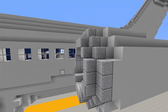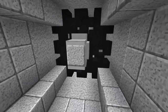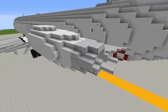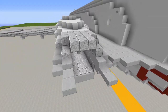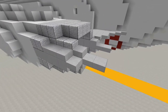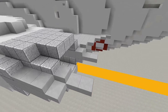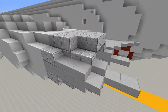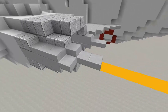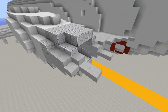On the inside of the engine you can see the fans of the forward compressor and the spinner against the main turbine shaft. Coming towards the back we've got the engine exhaust, and these pin-like things coming out of the exhaust are for the thrust reverser mechanism. Like a lot of turbojets of that era, the JT8D used bucket reversers where entire sections of the exhaust would hinge out along the fairing track to form a single scoop at the rear and redirect thrust forwards to slow the aircraft down.